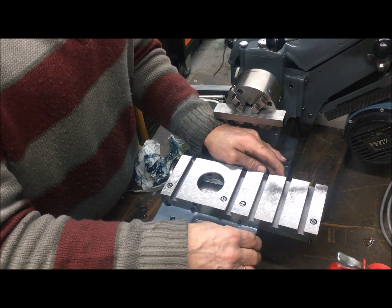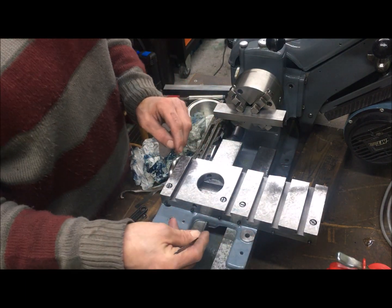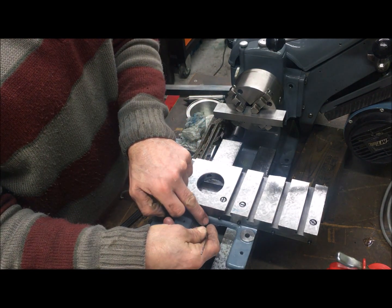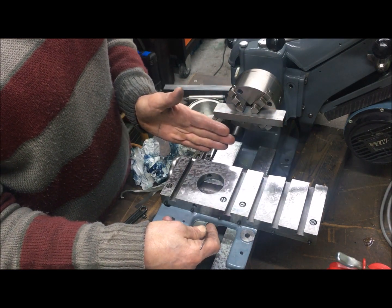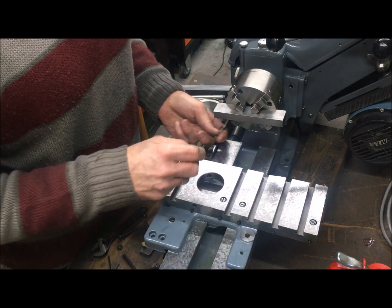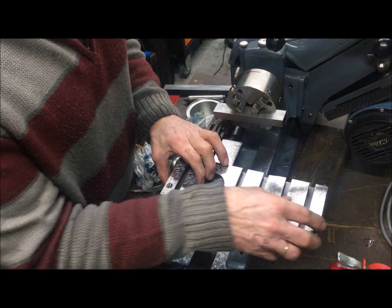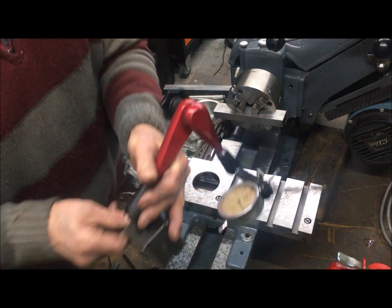Now I have no shims there, but I've scraped. Let's say I insert here — if I find that five hundredths of a millimeter is needed to get it all lined up, I need to scrape on that side the same amount. In this case I scraped here because I inserted shims here, and it was about three to four hundredths of a millimeter.